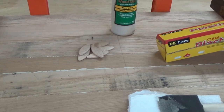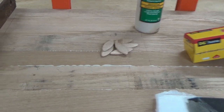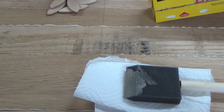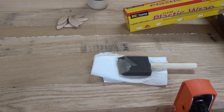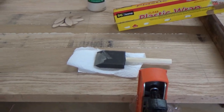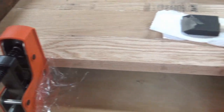Although I trust Titebond 3, I tend to use biscuits because I don't want this thing falling apart or warping and have them come back with an issue. You can see those lines — I do the edges and one down the center — so there's 18 biscuits total in this 24 by 32 foundation.